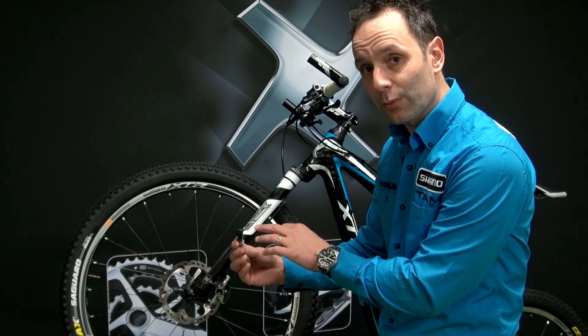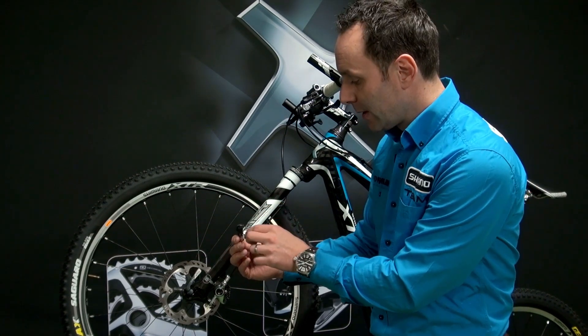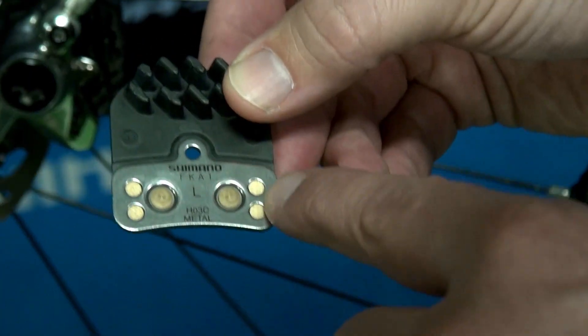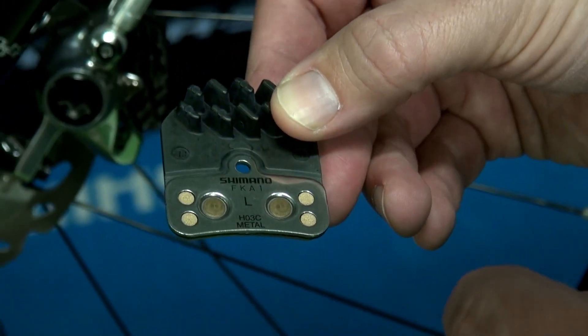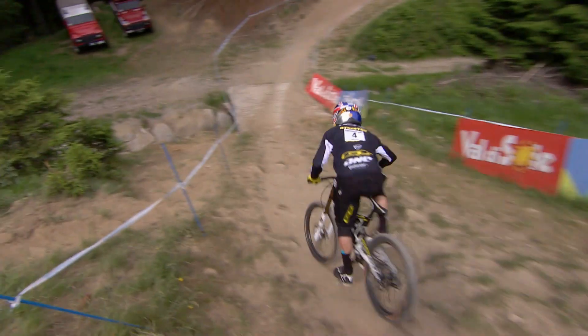The base plate of the cooling fin is made out of alloy. Alloy transfers heat better than steel, for example. To create still enough stiffness we still use a steel back plate, but the construction of the cooling fin is made of alloy.